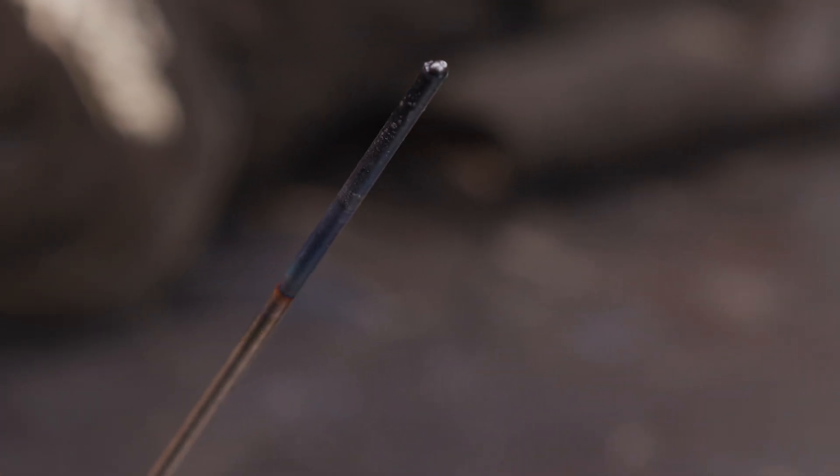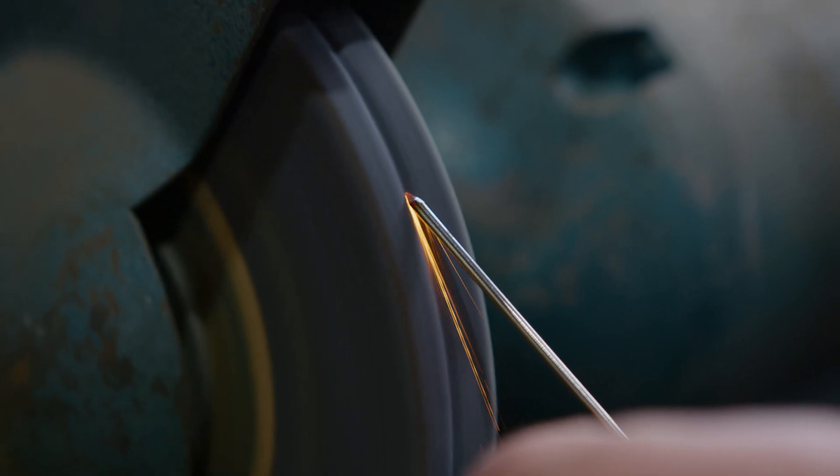If you've dipped your tungsten into the weld pool, don't worry — you're not the first, and even seasoned welders will slip up sometimes. You'll need to re-grind it into shape before you can continue to use it. If you've dipped the filler rod directly onto the tungsten, these can still be salvaged and re-ground — you'll just need to snap the contaminated end off. This is also true of long-term use contamination and discolouring. You can snap the contaminated part off and grind it into shape until it gets too short to use. Tungstens that are more resistant to contamination will not suffer as much discolouration, or have as many contaminants stick to them if dipped, and will take longer to dirty from extended use.